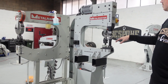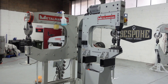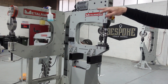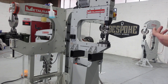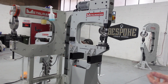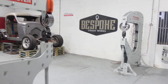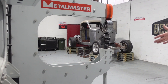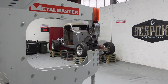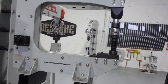The little power hammer I use predominantly as a reciprocating machine. Then we've got a range of English wheels — we've got the smaller one here with a smaller throat. It's got the two-inch dies which is just really handy for getting into certain reverse curves, areas where the normal three-inch die won't be able to get into. This was the first prototype machine that Machinery House had sent me — this has done half of the Auburn and it's a beautiful machine. It's quite rigid but it's got enough flex in it where it's not going to overstretch and all that sort of stuff.